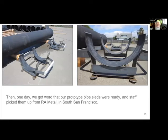So in the meantime, I asked a fabricator to fab up these sleds. I mean, just a trial run on these sleds to see if this would even work. So you could see the steel runners, you could see the frame, the insulator bands. I used the same thing and just welded those on. And then I also added outriggers, and because I have the ultra high molecular weight material, I thought, well, let me put it on the outside, and that'll keep the pipe aligned side to side, and the sled would hopefully slip right along, and then it was time to try that again.